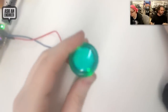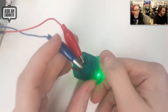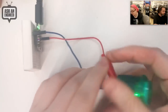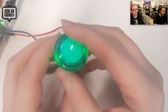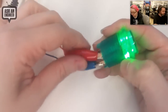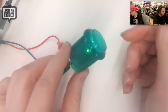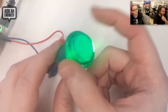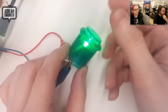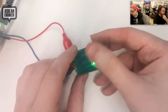And they have an LED in them. So these are arcade buttons, and these are the switch part, and there's an LED. I'm just showing you can pulse the LED on and off — it's connected here to a Trinket that's just doing the PWM. When you want to add a fun arcade button, it's not too big. It's kind of smaller than most — it's 24 millimeters. It comes with a little screw part that I removed here, but you can attach it to pretty thick material: wood, plastic, metal. And then you can have the LED light up when you press the button or not at all.